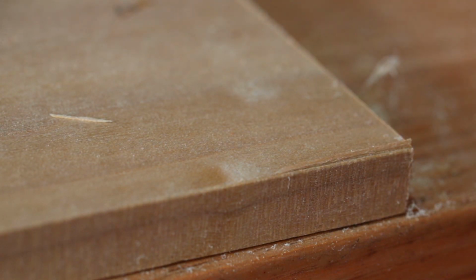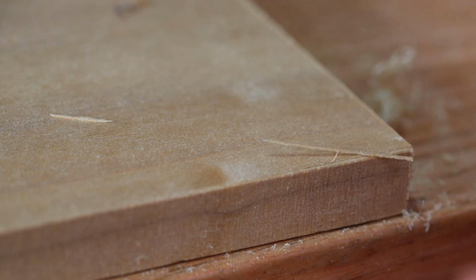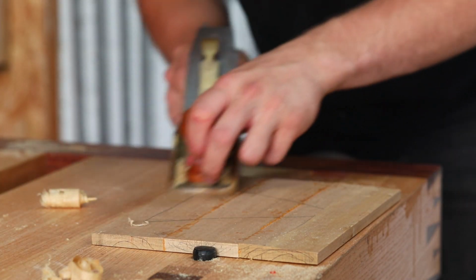That's the material just breaking off above the marking gauge line, and it shows that you're exactly where you want to be. You may also see that a thin white line is produced on the edge as well, which is the burnished material left over from the marking gauge, and obviously it's just been exposed after breaking off that wispy bit. So if you see that very fine white line along the edge, then that's probably the marking gauge line that you're aiming for.